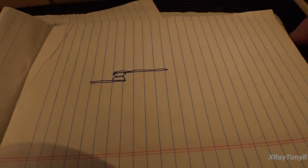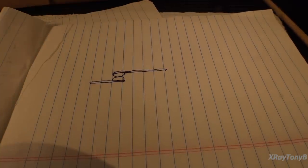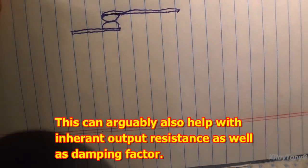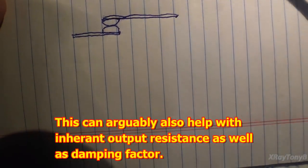But those contacts are called bifurcated contacts. And the whole purpose behind that is, instead of having one large contact that's covering only a small part of that area because it's curved, it actually has two smaller contacts that are in parallel. So even though each contact is a little bit smaller in diameter than this, if you combine the actual contact surface that actually touches one another, it's actually a lot bigger surface area, and it spreads that current across a wider area. And that's the importance. That's why they use those bifurcated contacts.